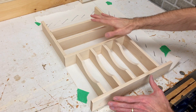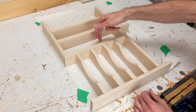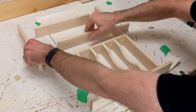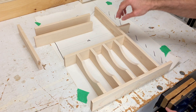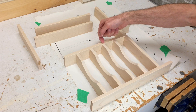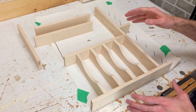I'm going to put all this together with both nails and screws. I'm going to put two screws in the front of each of these just to lock this in really tight. I'm going to use an air nailer and just put nails in these sections here, but I have to put this together in the right sequence — I can't get in here if these parts are here. These have to be out of the way to get this together, then I can attach these parts, and then come back in and finish that. If you don't have an air nailer, you can use a very small drill bit to drill a pilot hole and then drive your nail in — that will make it much easier using something as hard as maple. So I'm going to assemble this and then start putting the finish on.